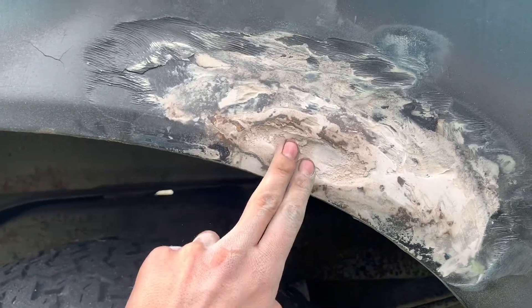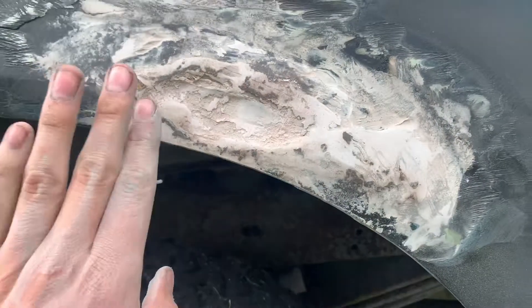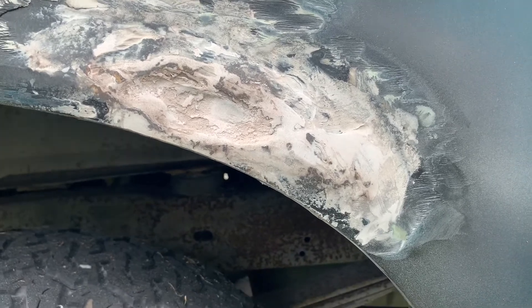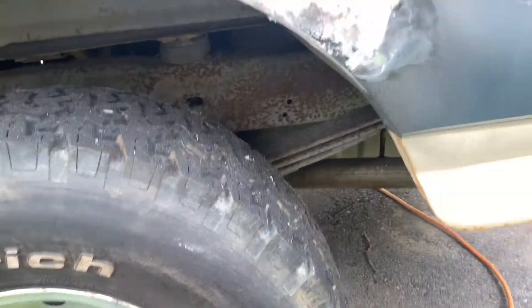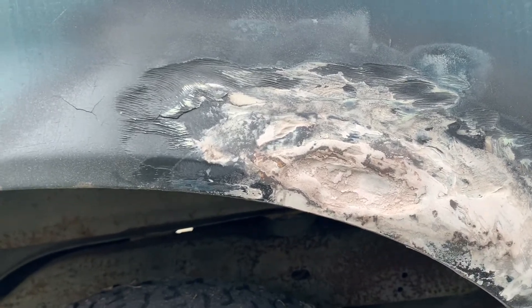For sanding I'm just using an electric sander, not doing it by hand. If you do it by hand, it puts points of pressure on it and makes it uneven. If you do sand by hand, people use like a two-by-four wrapped in sandpaper. I'm using the electric sander because it can't really push down on one spot, so it keeps it smooth all the way through.